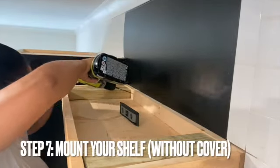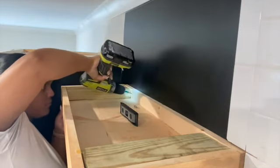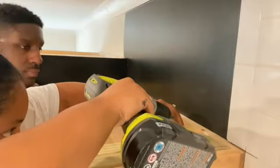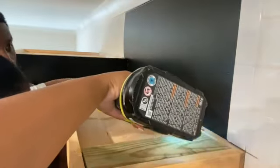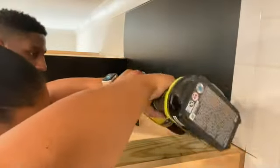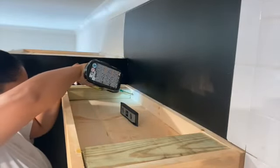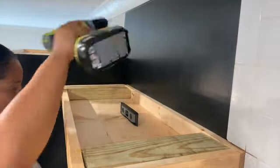I've left my shelf top open because I'm going to drill right through the backboard from the inside of my shelf and into the wall. Be sure to find your studs, and then I'm taking the same multi-purpose screws we used before and mounting. I'm using a method I actually saw another YouTuber use, where she drilled at a downward angle — it kind of acts like a hook when you screw into the wall this way. And of course, once everything's screwed in, it's time to attach the top.